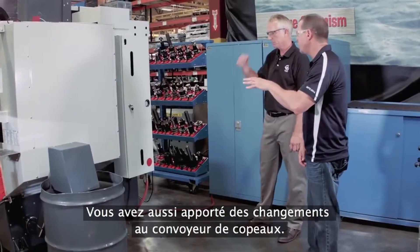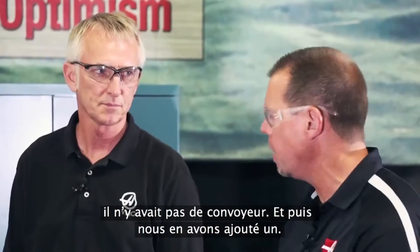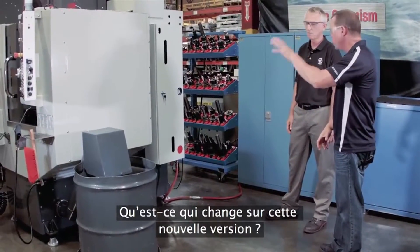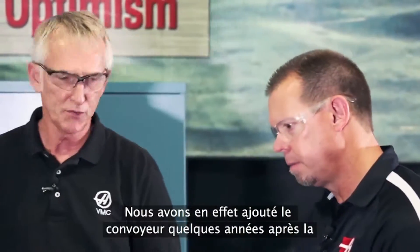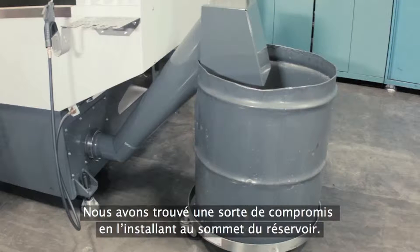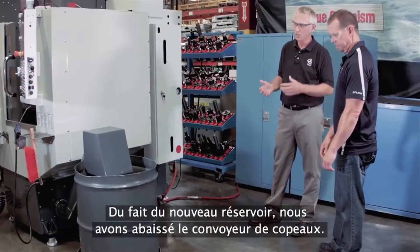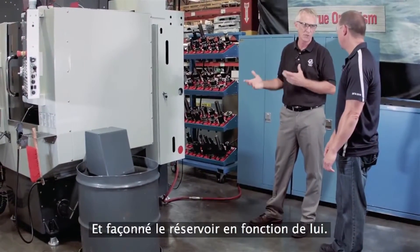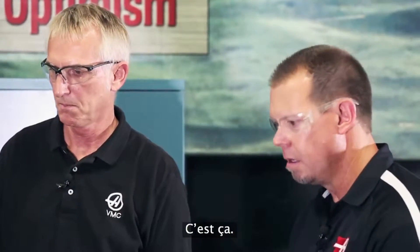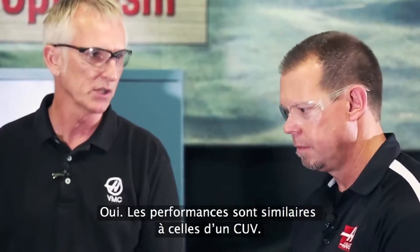I know you guys made some changes to the auger. At first we didn't have it, then we added the auger — so what's different about this on the newly redesigned machine? Well, we added the auger a few years after the introduction of the Mini-Mill — it was kind of a compromise, it sat on top of the tank. With the new tank, we've actually got the auger lower down in the coolant, and we shaped the tank for the auger, so the machine was designed around the auger. It does a much better job of getting the chips out of the machine — it's more like a regular vertical in that respect.